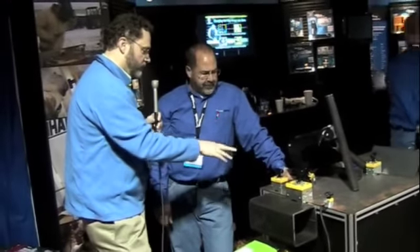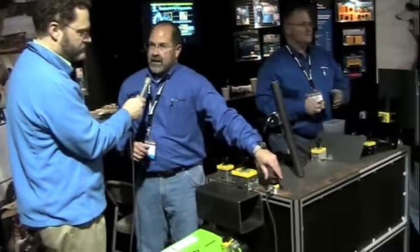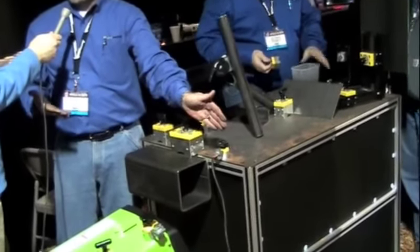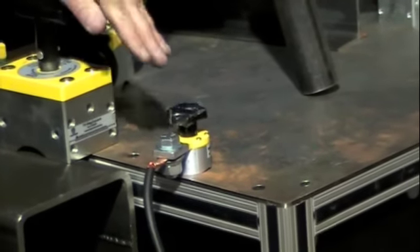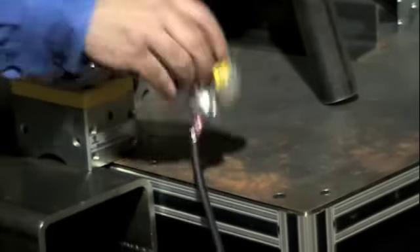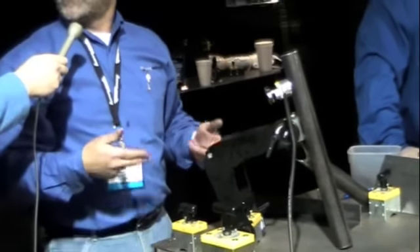We do have smaller models for small tabletop work, also very popular with the woodworking community. While we don't work on wood itself, we do work on the cast iron table saw and other machinery they use. We have larger ones available as well, such as the heavy lifters. We also have entire other families of products — right here in front of my squares is a welding ground clamp. A major problem when working with a larger piece of metal is where to put an alligator clamp. Simply take our ground clamp, hook it up with a copper lug, put it in place on a piece of tubing or flat stock, turn it on, you're grounded — start welding. So much faster, so much easier. As long as it's good bare metal-to-metal contact, they should do well for years.